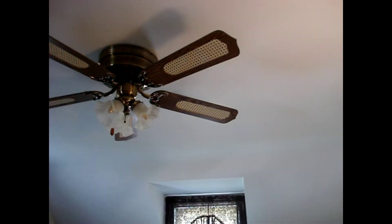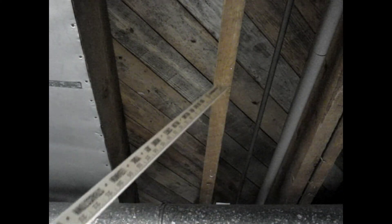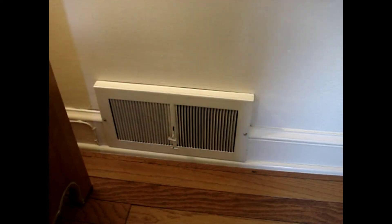Install at least 36 inches away from the tip of a ceiling fan. If the ceiling has open joists, mount on the bottom of the joists, not between them. Install at least 36 inches away from supply registers for heating and cooling systems, and out of direct air flow from these registers.